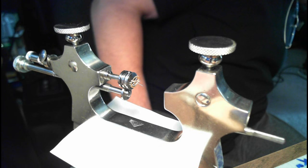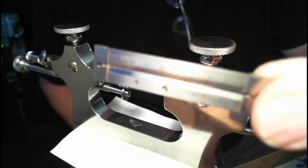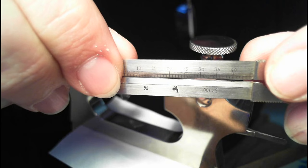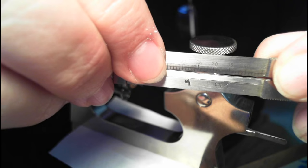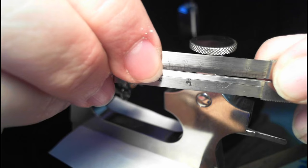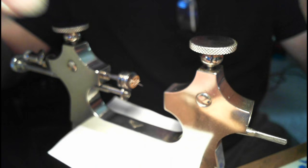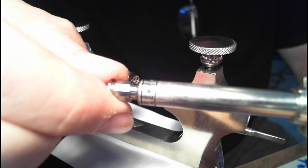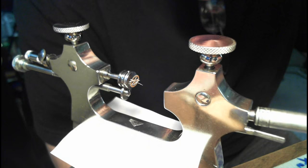Here's the gauge here. And all you do is you slide the pivot into the hole of this gauge, and then you slide it down until it stops, and there's a number on the side. You see the numbers there? And the numbers correspond to the pivot size in 1/100th of a millimeter. So this thing stopped at 15. So what you do there is you take these rods here, and on this end here, there's numbers, and you find the corresponding number 15. And that number goes up, and then you put this into the Jacot tool with number 15 pointing upward.